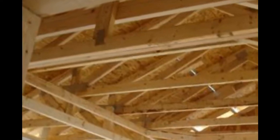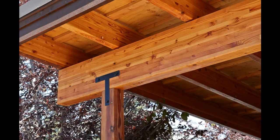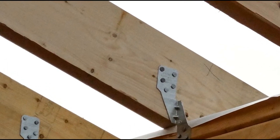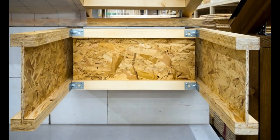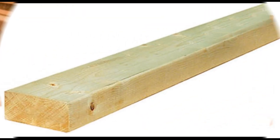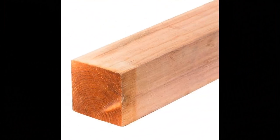In Jamaica, the frame of your roof will consist of your beams, trusses, rafters, and so on. You will find two specific types of wood products available: engineered wood and milled wood. Milled wood is your normal wood — your two by four, two by six, one by one, one by two. On the other hand, you have manufactured wood, and in some instances your manufactured wood is far better.